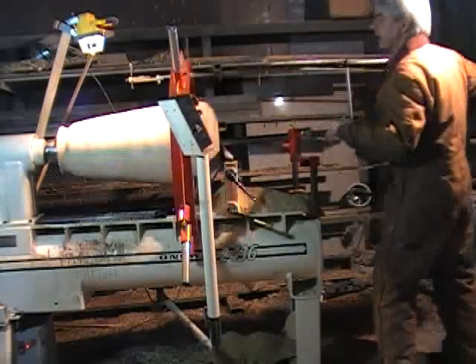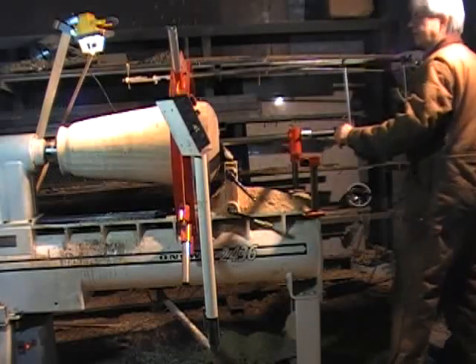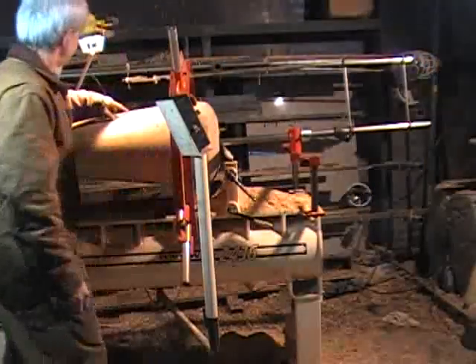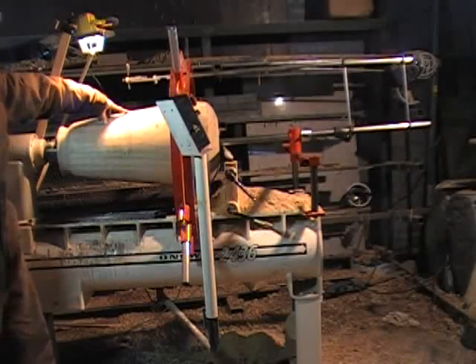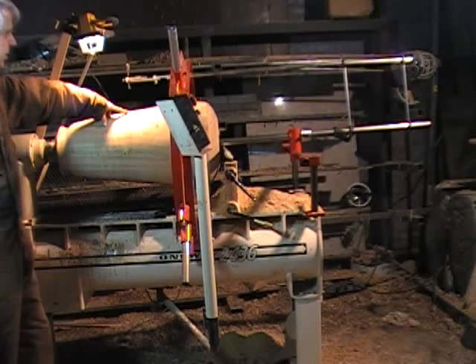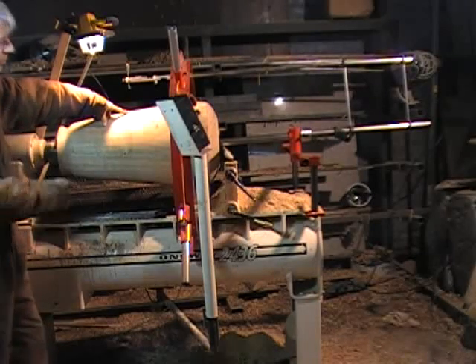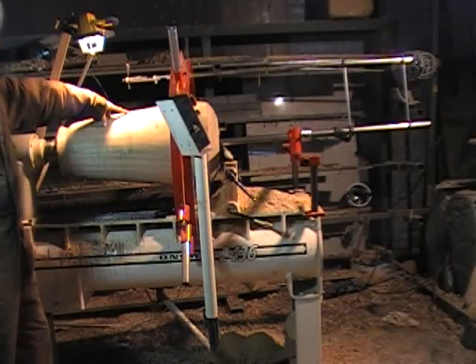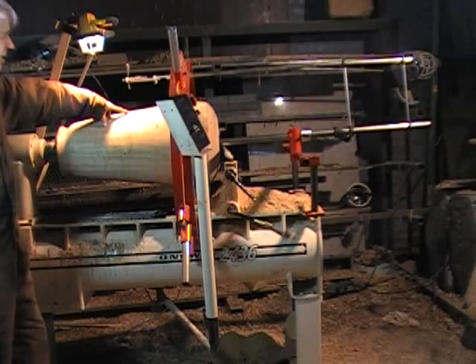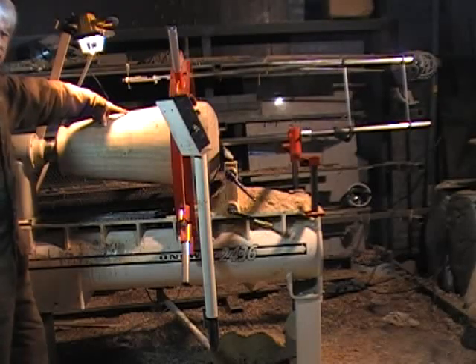So let's see how deep we are on this base now. It's around the depth of the hollow, and here's the beam — you can see how deep we are going. It's really not a challenge to continue to go deeper. Even with a three-quarter inch holder sticking out as far as that one is, we can recess it deeper so that we're only flexing the inch and a quarter bar, which is going to make it even more stable with less chattering as we hang out over that tool rest.